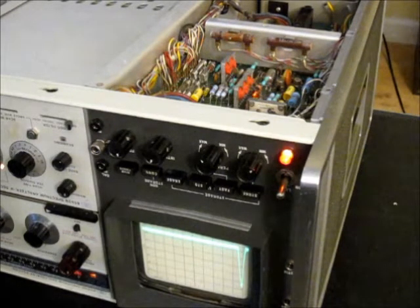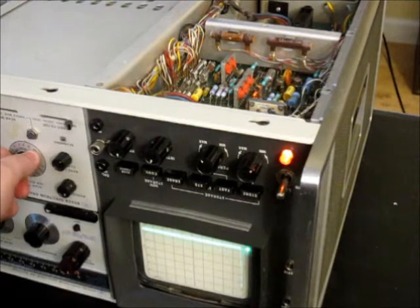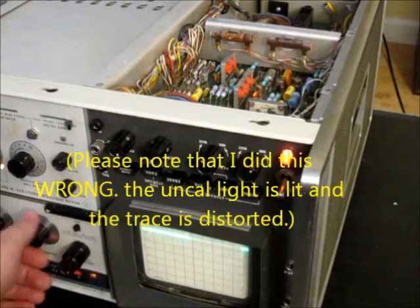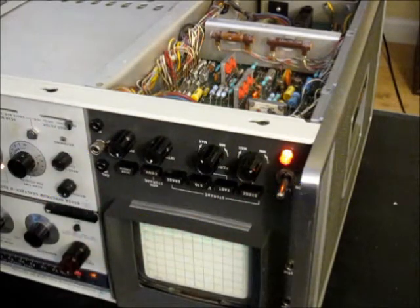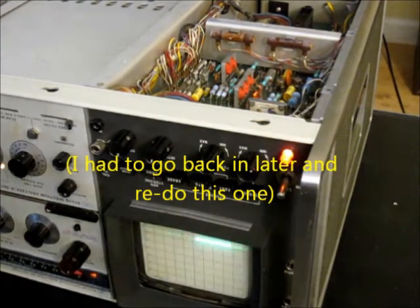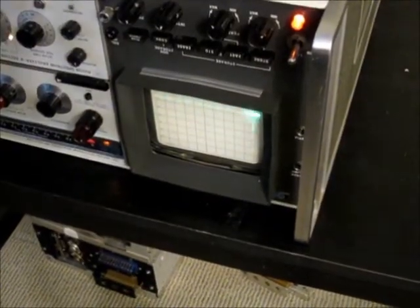I'm going to narrow the resolution bandwidth and increase the scan time a little bit just so there isn't any distortion from that, until I have a nice vertical peak that I can use to adjust from. Basically you want to get that adjustment as straight as possible. The adjustment pot is in the high voltage section — it's this one right here. That is the geometry adjustment.